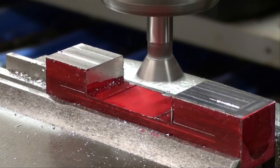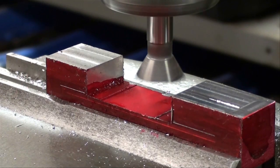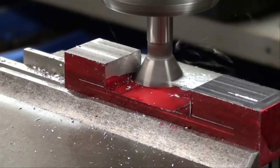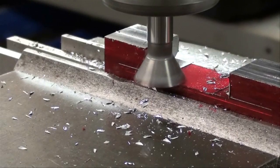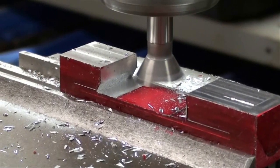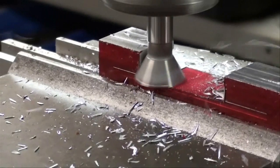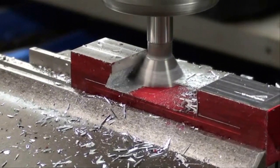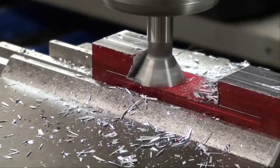So I've got that good and tight. Now let's take a couple of cuts and watch the red layout die — remember I've already set the depth. We can take some rather heavy roughing cuts to start with, because we're not taking much off. As we get further into the dovetail, lighter cuts will be necessary. I also like to take my last pass climb milling to get a little bit better finish.